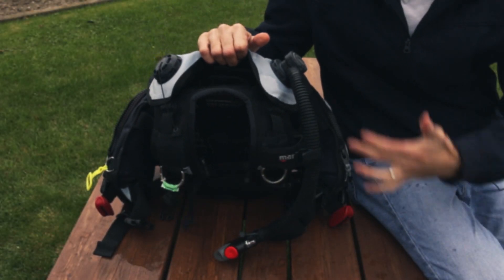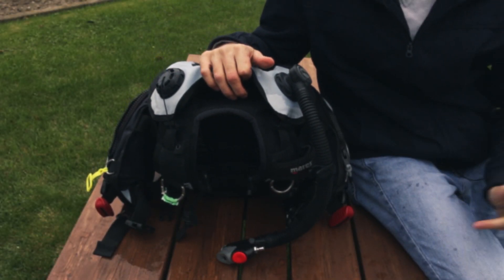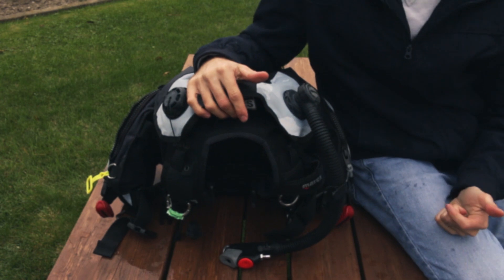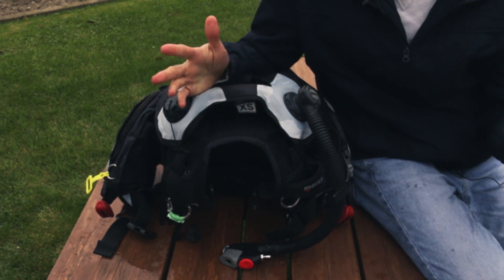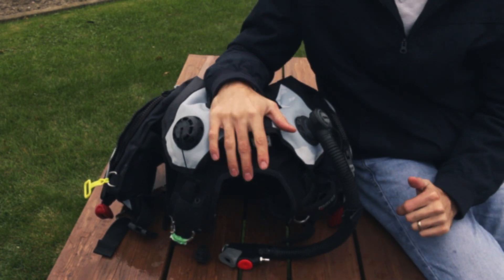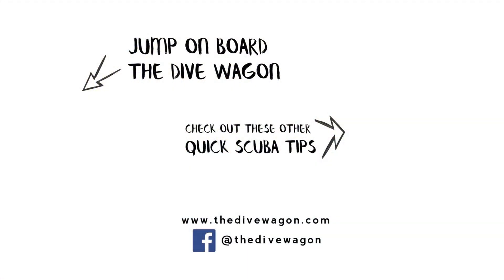Dunk tanks are fine if you're on a dive trip or on a boat, but unless you're the first person with the first piece of equipment into that dunk tank, everyone else after that is basically getting rinsed in salt water. So you want to make sure that when you get back, you thoroughly rinse all of your gear, especially your BCD. And if you aren't comfortable doing this task yourself, you can take it into your local dive shop and they will be more than happy to help you rinse it out. And there you have it — how to rinse your BCD. If you have any questions, leave a comment below and we'll be happy to hear from you. See you next time and happy diving!